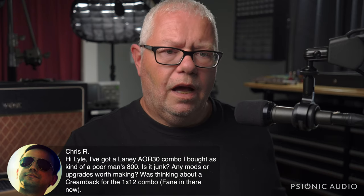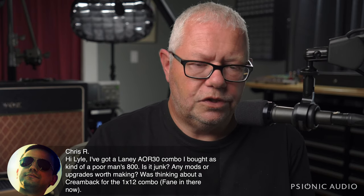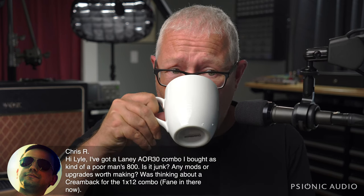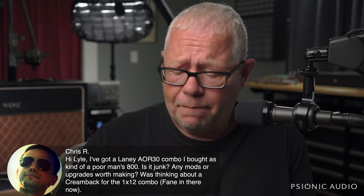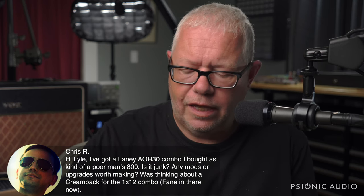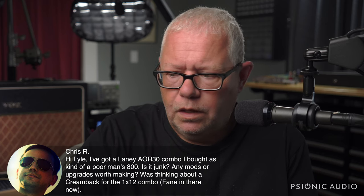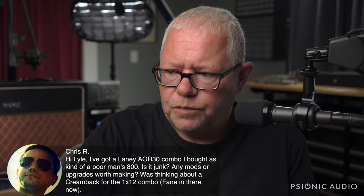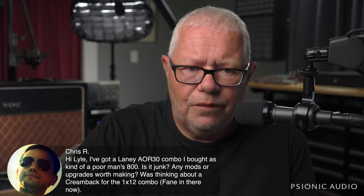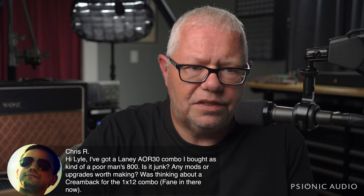Hey, Chris R. I am not familiar with the Laney AOR-30 combo, so I cannot tell you whether it's junk. I will say categorically, it's not really worth modding. Upgrades to those amps, without looking at it, I can't tell you, but in general, there are things you can do on anything. If it's a Marshall-style amp, make sure it's got adequate screen grid resistors. That's not really a mod so much as a reliability thing. I wouldn't put too much money into it either way. I wouldn't worry about upgrading it or modding it in the slightest.